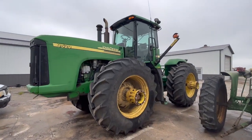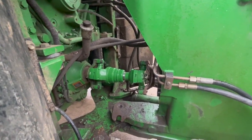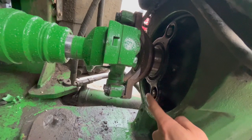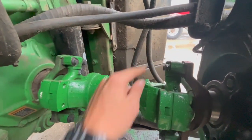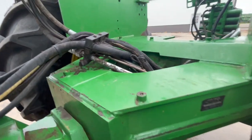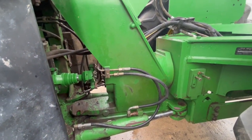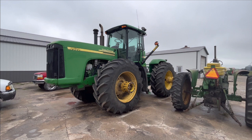Got this tractor done here. Just go over a few things: this piece right here gets torqued to 750 foot-pounds, so you'll need a torque multiplier for that. These bolts here are 110 foot-pounds — I do remember that. Otherwise the rest of it, just hit with a heavy impact and make sure they're good and tight. After changing that carrier bearing, you need to drive it under 10 miles an hour for at least six hours before proceeding to higher speeds.